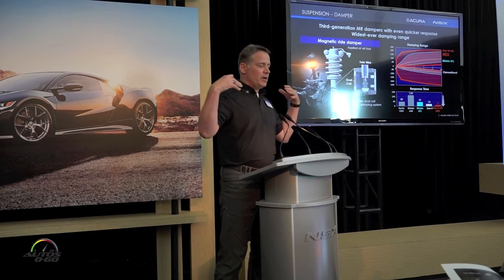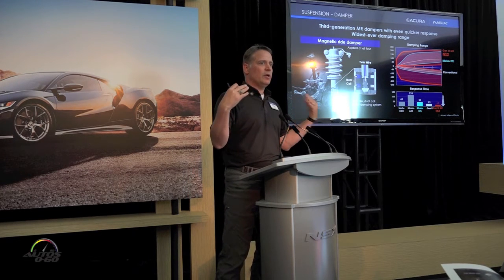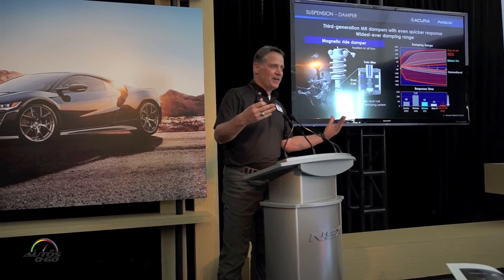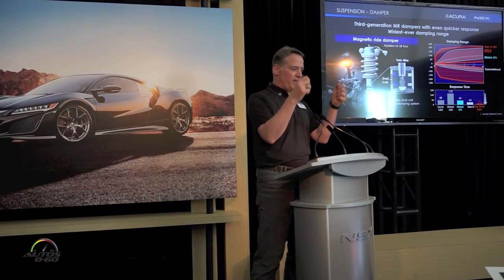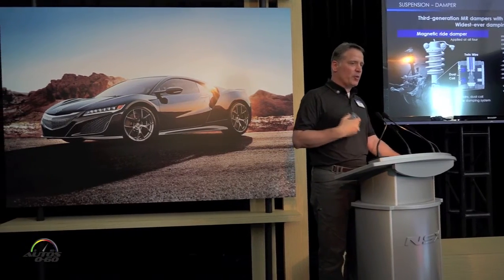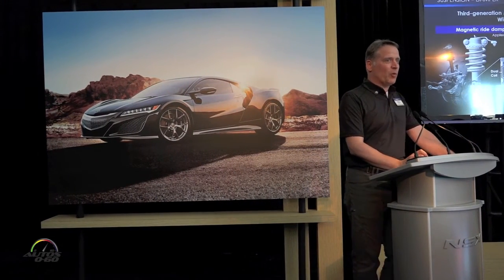At the same time, it's not about ride comfort — we're trying to stabilize you in the seat. We're not necessarily trying to minimize body roll or pitch angle. But if you're stable in the seat with no extraneous motions, you can have that much more fidelity in your steering. The inertia of your body in the seat actually causes stress on your brain and unwanted steering inputs.